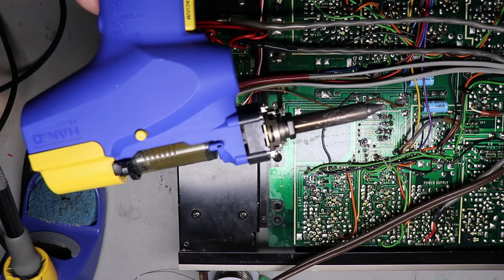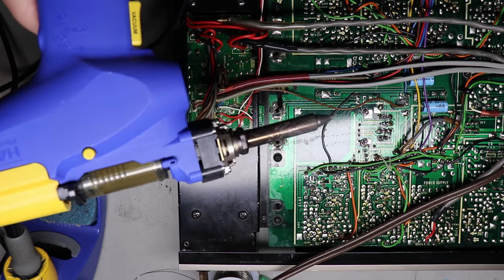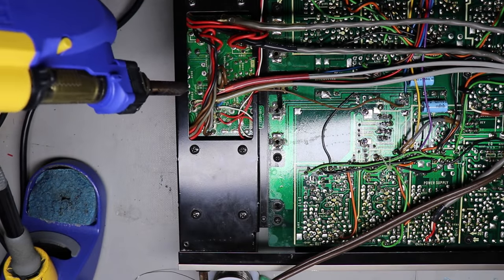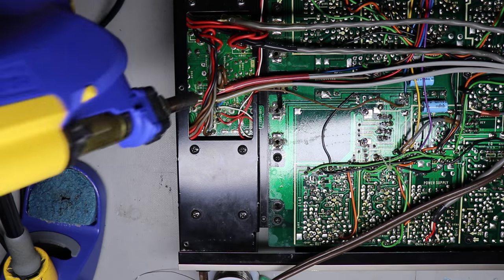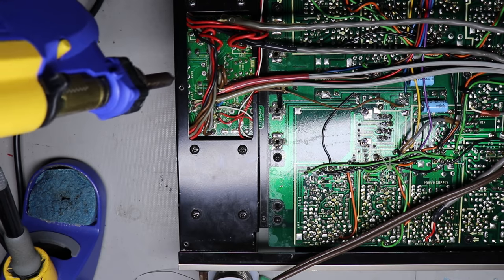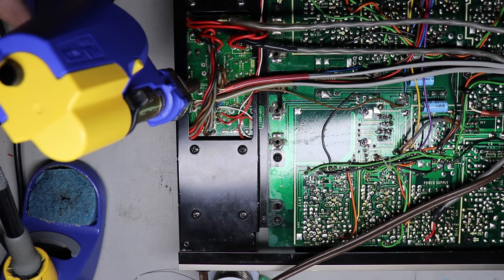So I'm going to try to show you here how easy this is to get these components out with this tool. There's a hole in the end of this tool, and this hole goes right over that old capacitor leg that's sticking out. And then it melts the solder, and as you're pushing down slightly, it gets right down onto that eyelet. So I'm going to try to show you this and see if I can...